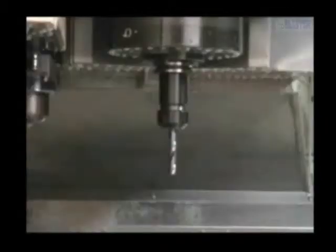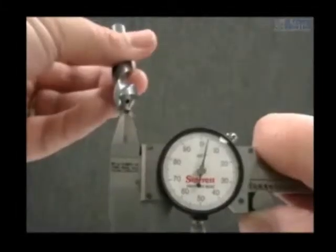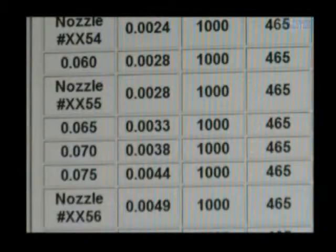The coolant concentration must be at least eight percent for normal lubricity coolants, and higher for many synthetics. The drill must pass ten gallons per minute per inch of tool diameter. You can measure the hole diameter and refer to the flowcharts in the technical section of the Chip Blaster website.